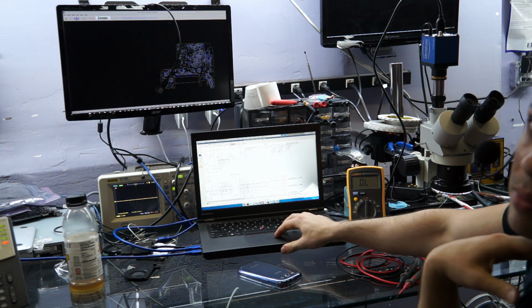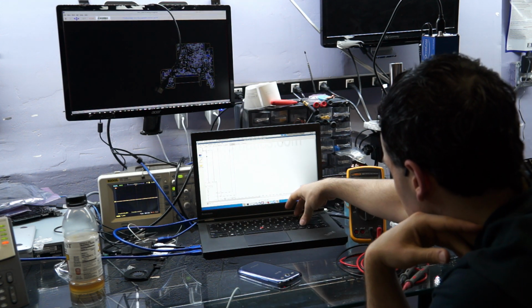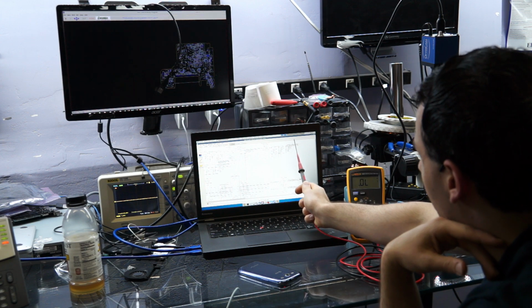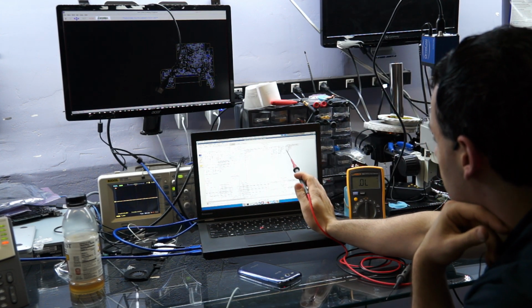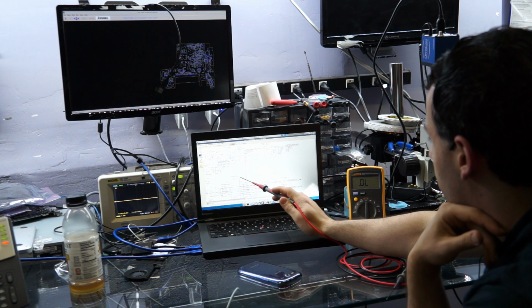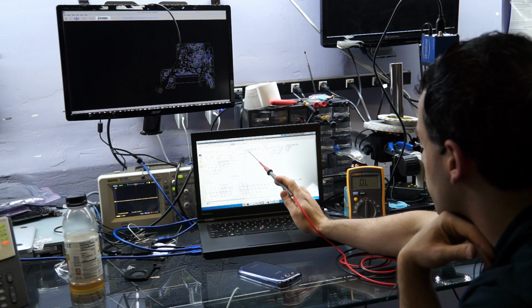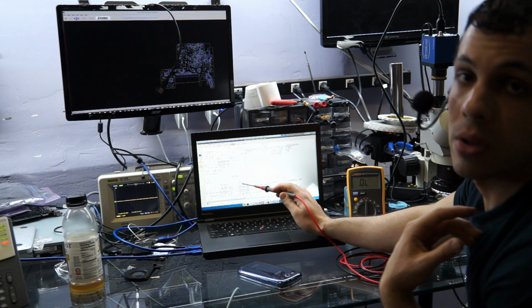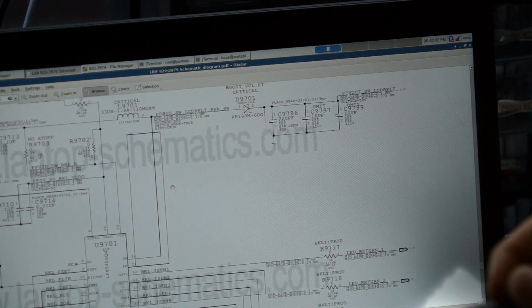Now, this is a really bad schematic to be showing this to you on. I don't know why the schematic is put out this way. I really don't. But the feedback trace over here is supposed to usually be from the output of backlight. The way this works is this creates a backlight signal. Now the chip monitors it and pretty much puts out voltage based on what it's putting out. So it puts out the signal here. That then goes past this boost diode, and you get the actual output of the backlight. And usually there's this feedback trace. Wouldn't it be great if I actually zoomed in so you can see what I'm talking about? Now let's start that again.